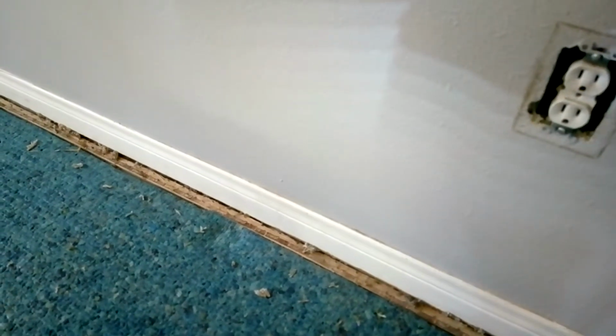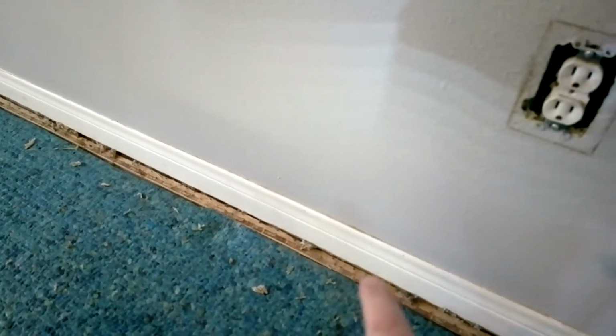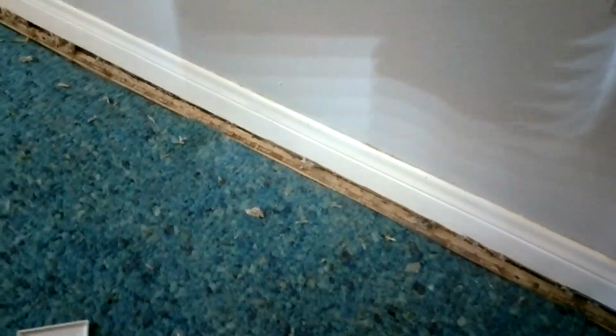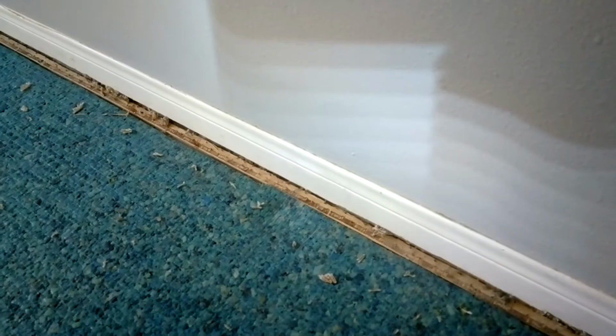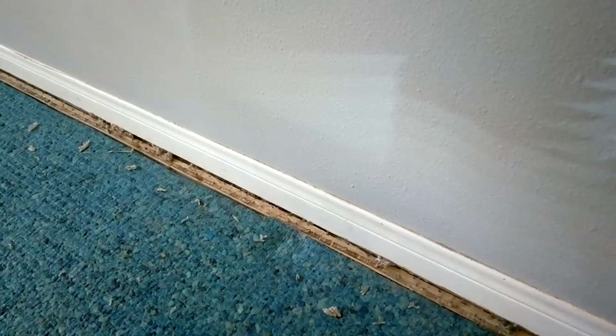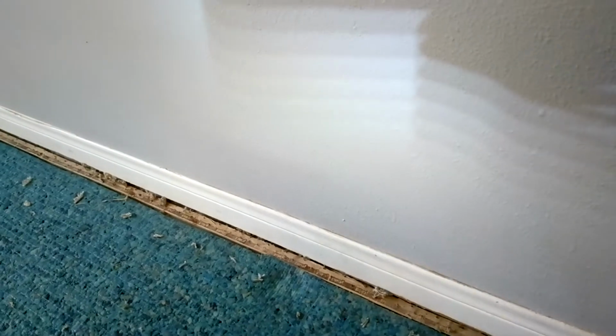So what we'll be doing, I think, is taking a little bit of sandpaper to buff up this right here, because I'm not too sure what it is. I think it's probably just semi-gloss, if they're even matte. It could be matte. It could be flat probably now. So either I'll just clean it up, but if it shows glossy, then you really have to get some sandpaper on it and sand down the surface lightly, wipe it down, and then it'll be ready for more paint.